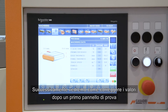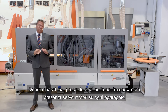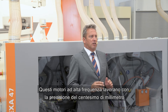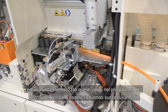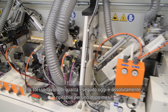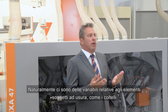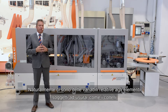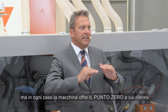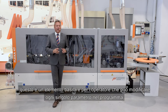This machine in our showroom has servo motors everywhere. These high-frequency motors work with precision of hundredths of millimeters. When you find the correct position for the first time, you can store and record it in our computer and recall it anytime. So the job you produce today is repeatable even after months. There are some variables with consumables — for example trimming tools wear or imprecise edge thickness — but the machine always offers the ideal zero point as a starting reference, which any operator can modify.